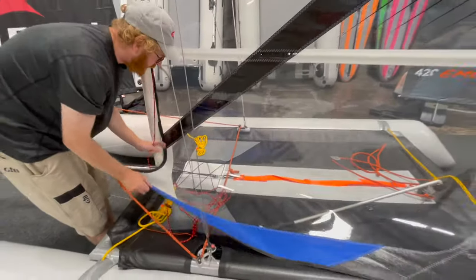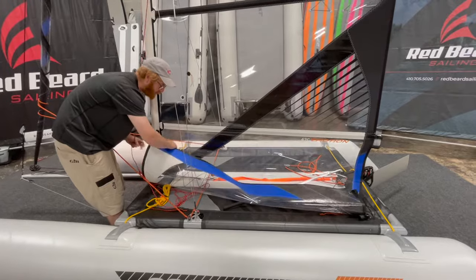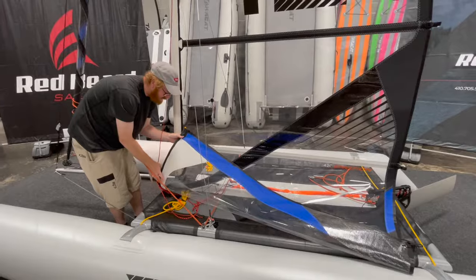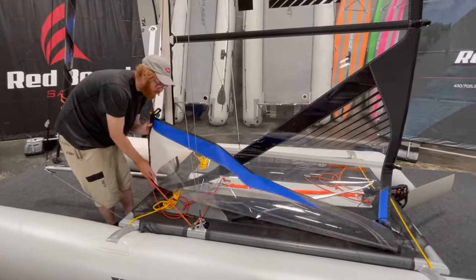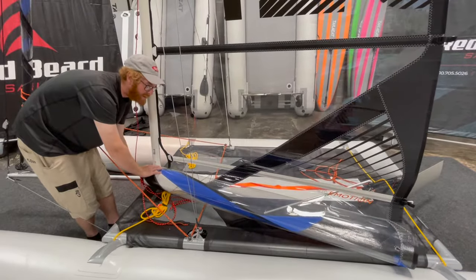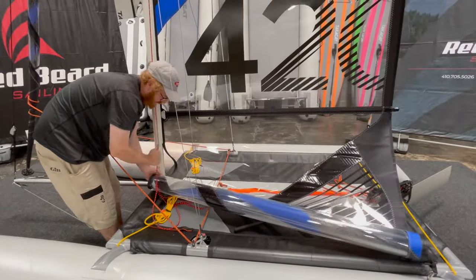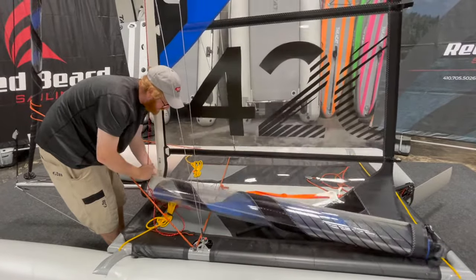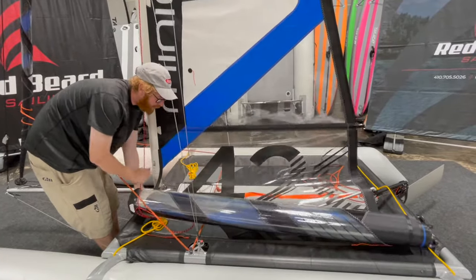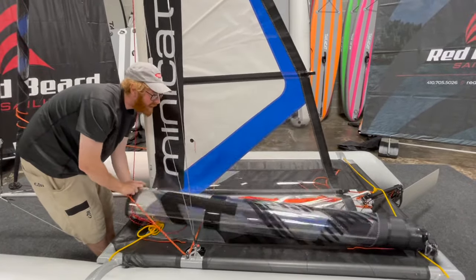This can easily be rolled as one person. You take a nice big roll and you're controlling this bolt rope. I started here, got a nice big roll, and then curled it under using the bolt rope to twist. You'll see I can get a nice tight roll here. Try to manage that halyard as things come down and just roll it as it comes down. It doesn't have to be perfect, but you do want to get it reasonably tight, and then you're going to tighten it up once it's all the way down.